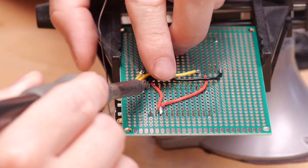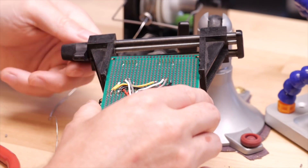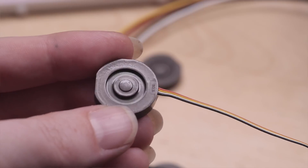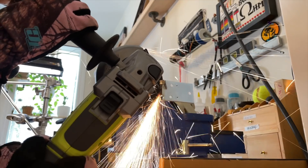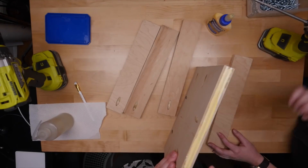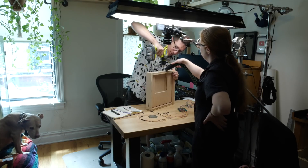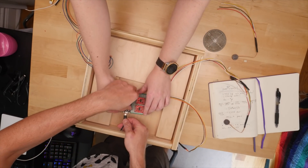Next up, it's time to build the scale, starting with the electronics. We soldered up a perfboard version of our earlier circuit prototype and attached the load cells with long wires. Typically you would use four load cells to build a scale, one in each corner, then a plate presses down evenly on the sensors. We constructed the scale out of pieces of scrap plywood, reinforced the corners with pieces of metal so the heavy tank doesn't deform the plywood onto the sensor. The scale consists of a base piece, a top plate, four side walls, and a middle piece where the load cells live, with a cutout for the electronics. No fancy woodworking here — just a few pocket holes. This design is also suitable for building a scale inside a kegerator; just adjust the dimensions to fit your keg. You can find the step-by-step instructions and sample code at the link in the description.